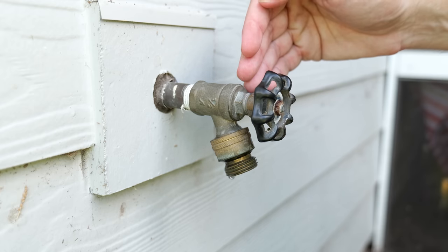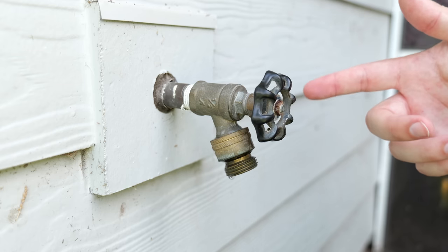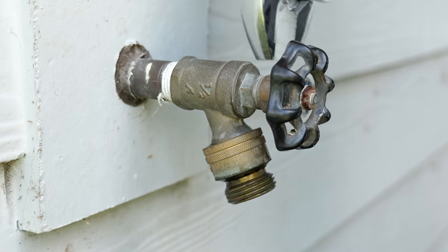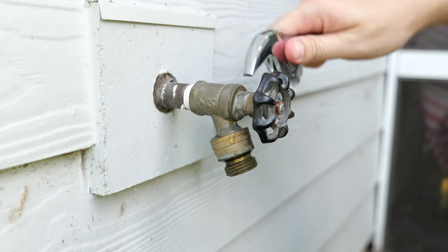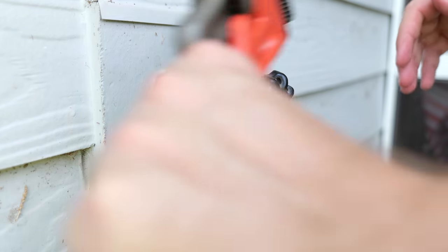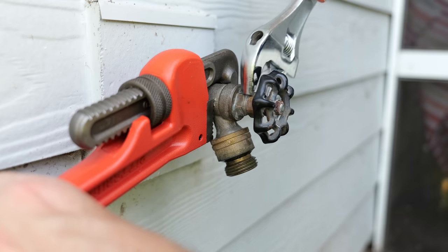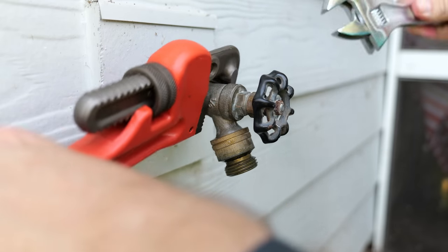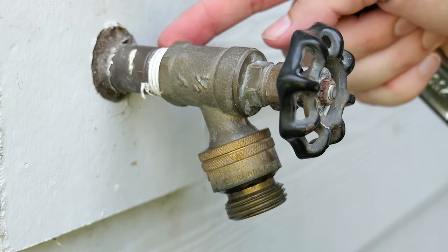The easy fix is just to try and compress that washer inside even more, and by compressing it hopefully we can stop the water from leaking. Take an adjustable wrench, put it on the hose bib where it looks like a nut, and turn it to the right or clockwise to tighten it down. If you want to be completely safe, take a pipe wrench and put it on the faucet itself, then tighten with your adjustable wrench, pulling against each other — this stabilizes everything so you don't do any damage behind the wall or to your piping.